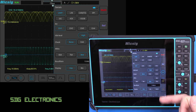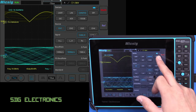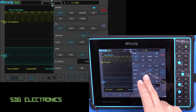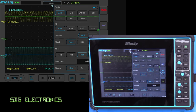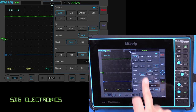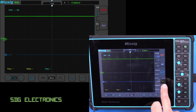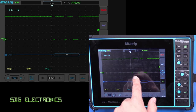And then we've got our serial decoders — S1 and S2 — so you can decode two serial channels at the same time. The options include UART, LIN, CAN, SPI, I2C, 429, and 1553. You can choose which channel you're receiving on, the polarity of the idle level, do parity checking, choose how many bits from five to nine, and the baud rate. I've connected channel four to a USB to UART converter, and if I type some numbers into the terminal, you can see they get decoded properly — we've got the oscilloscope waveform and also the numbers being decoded. We can display that as ASCII or switch to hex representation, and as we zoom in and out, the decoded bar matches the width of the waveform.